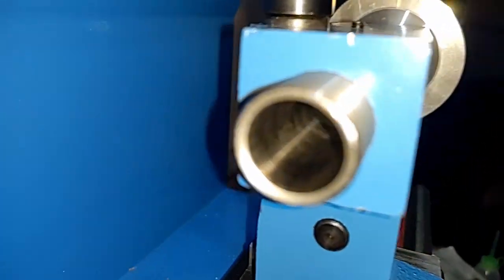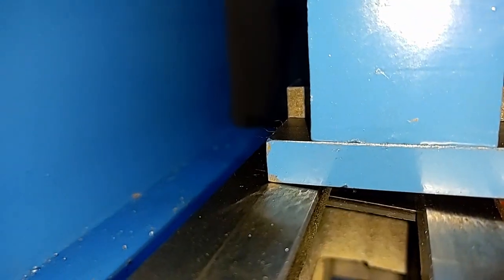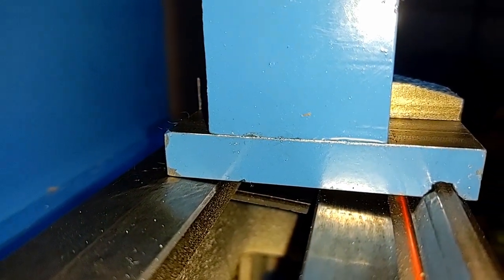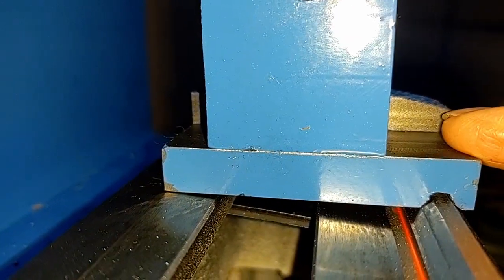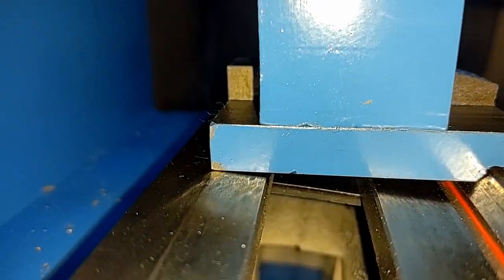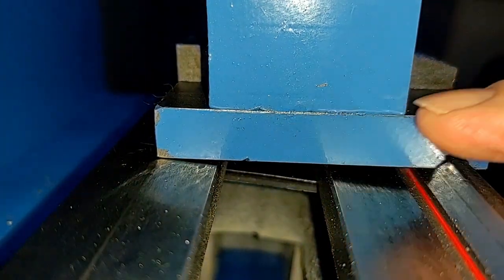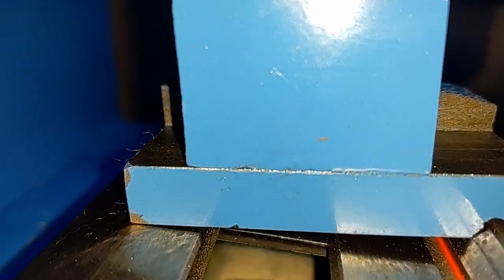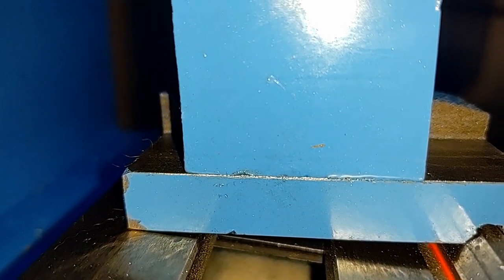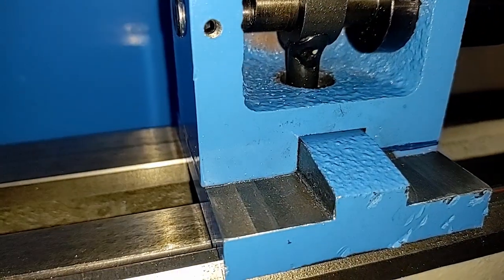And if you look, there's a hole there. Down here at the base — let me move the knob here on the lathe a little bit — you'll see right here just how horribly fitted up the plate here is to the ways. And the trouble is, it slides up and down the ways. It gets a little inaccurate. It's just not stable, and that is just not really acceptable.